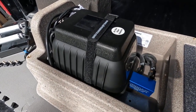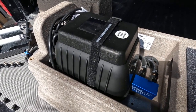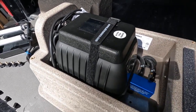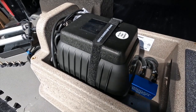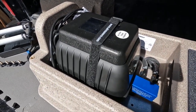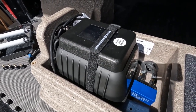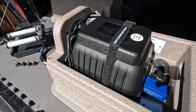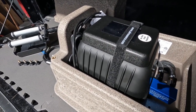This one probably costs less than $5 a month to run. It's very quiet — we just tested this for another video on sound output, and from 10 feet away it produced about 44 decibels, which is quite low. It's actually lower than normal conversation from 10 feet away, so it's a very quiet, efficient system.